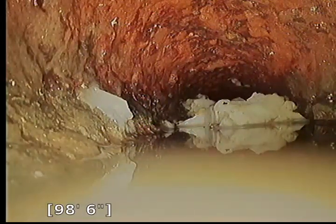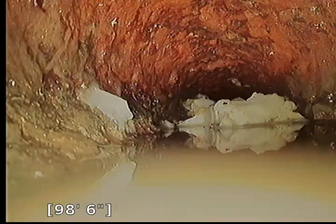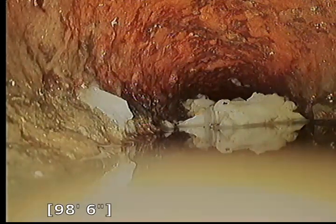We just went across and can see a bunch more debris. We're out at about 100 feet right now, and without running water and the amount of turns we've made, we're probably going to have to switch cameras to one that can push farther through this rough buildup. You can see paper and things that are getting slowed down and building up right there. We're going to push forward to this junction to locate and mark it. We've located this area in the front yard — about two feet into the yard on the other side of the retaining wall. The pipe is about three feet deep here, marked with a green-yellow flag that denotes the plastic-to-cast-iron transition at a depth of about 35 inches. You can see all that paper mounted up in that constant little lake of pooling water that's not draining out.